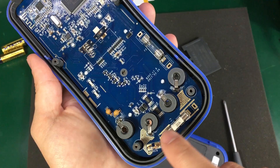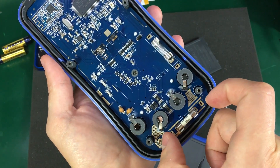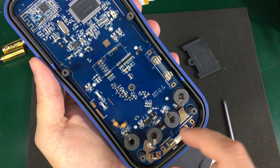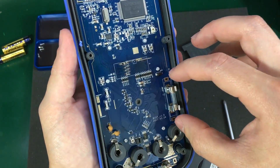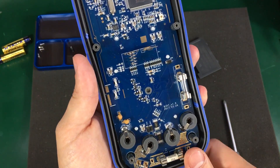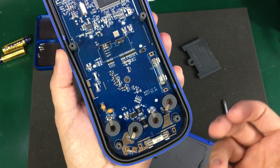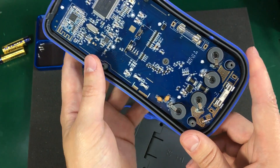About the fuses — we can see they have provisioned footprints for a larger socket, probably to accommodate an HRC fuse, both for the 20-amp fuse and for the 600mA one. So if one desired, they could install a larger socket and replace these fuses with HRC fuses for increased protection, but I don't think anyone would bother doing that.